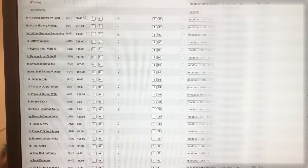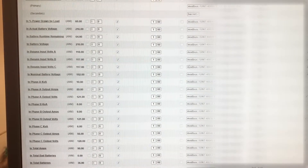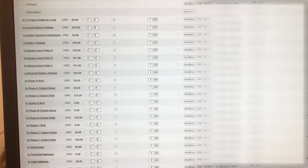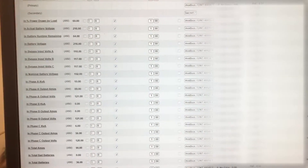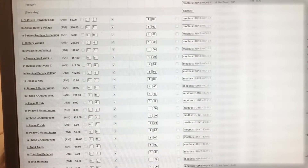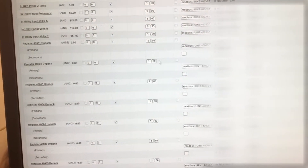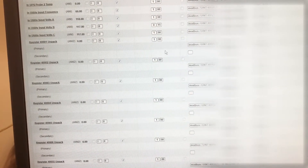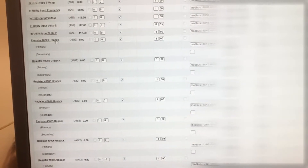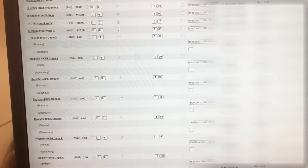As you can see, you have your point subscription and the current values being read — it is a Modbus integration. All the registers are Modbus unsigned 16-bit integers. You can see here the device is a single device so it's address one. There are boolean registers here — this is the main register unpacked.